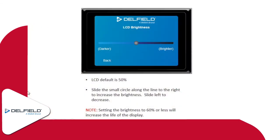LCD brightness is something that we really shouldn't be messing around with on these. The default's at 50%. You can set it brighter. You can set it darker. The company that we worked with when we developed the screen had mentioned that if the brightness was set too bright, that could cut down on the useful life of the screen. So we just want to make sure that we leave it right at 50%. The screen itself will normally last for up to about 12 years or so, usually with no issues there.